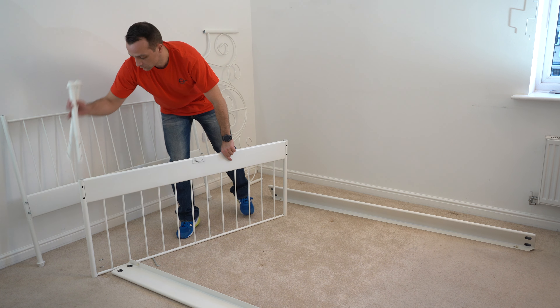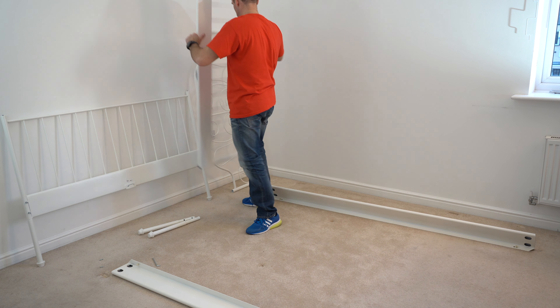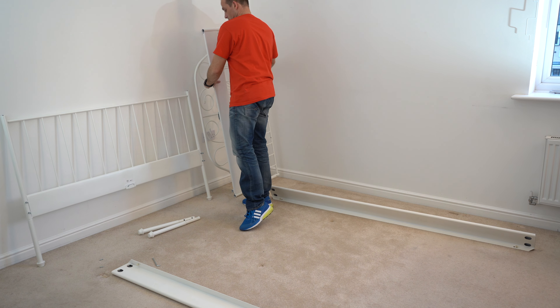Or if you think you're not going to lose them during moving the bed and you want to open it all up — that's what I'm showing you here — you can take the legs out. Open all the screws: you're going to have four screws at the bottom and four screws on the top part of the bed. Just take them out. Those top screws are holding the legs on the side and connecting the frame together. So just take out the legs and put the screws in one place — don't lose them, otherwise you're going to have a hard time replacing them. And this is all the parts the bed has.